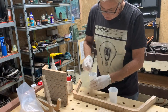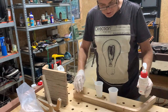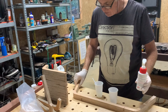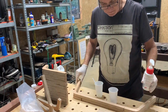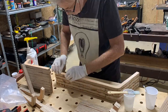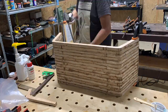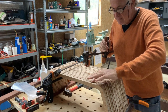I've got my rubber gloves on and I'm using epoxy resin with a very slow hardener, which will allow me to build this up and put the clamps on it. You can use an air gun and nail it if you wish, but this time I'm going to use clamps and glue. The slow setting glue will allow me to move it around and get it in the right position. Next morning I'm removing the clamps — it's dried fairly well.